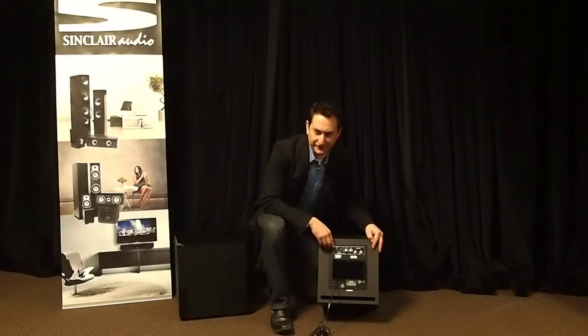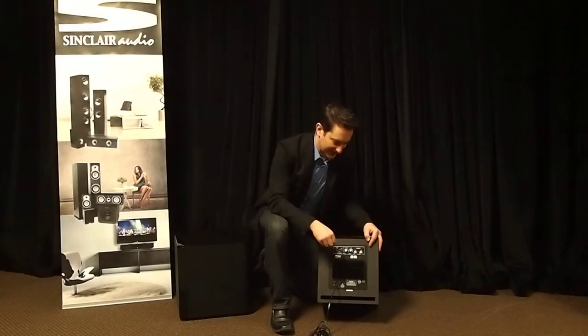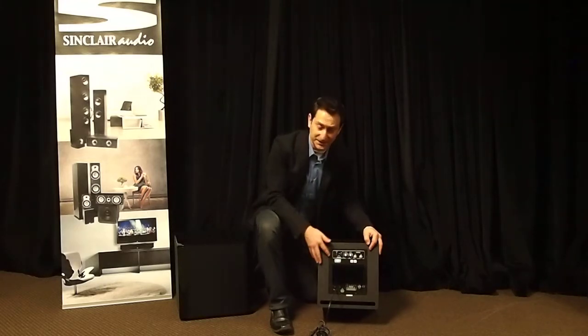You also have something called a phase switch. It is the fine tuning of a subwoofer. Ideally, you'd have two people to set this feature. You'd sit in your main listening position and have someone toggle the switch and see which one sounds tighter. There's no right or wrong with it, it's just the finest of tuning for a subwoofer.